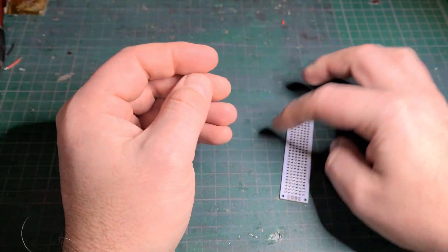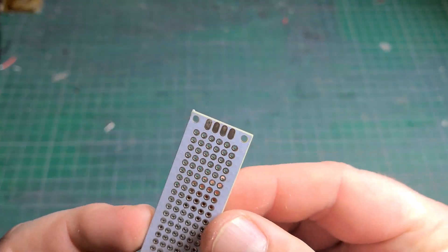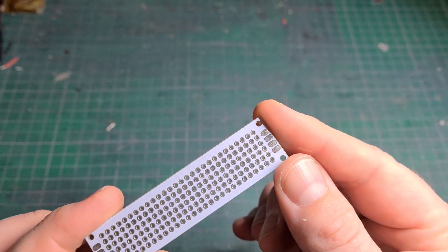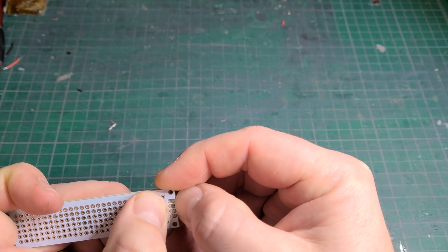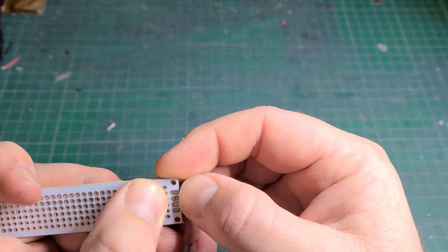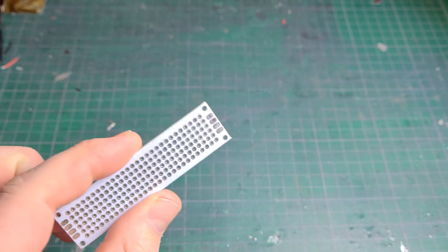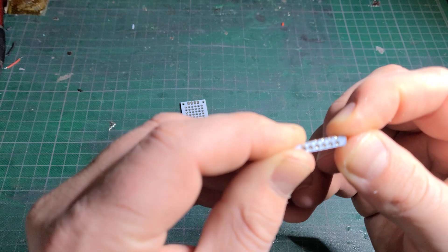To explain the concept more clearly, we'll do a quick experiment and actually build a burn circuit. What I have here is just a piece of perf board — a little prototype board. As you can see, it just has pads and through-hole slots for through-hole components, but none of these pads are actually connected to each other. All we need is just this little bit at the end, because we are going to stick it to our little CubeSat and wire it up to see how the circuit works.